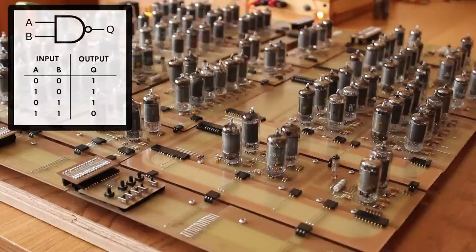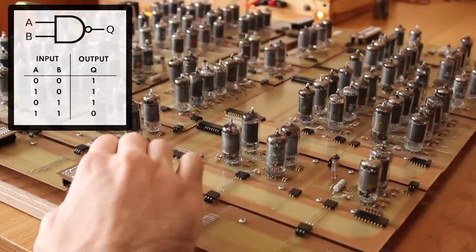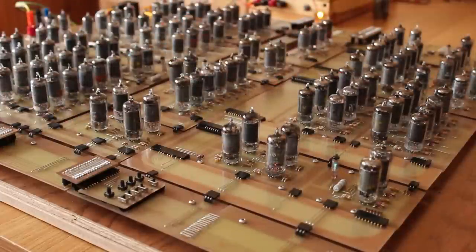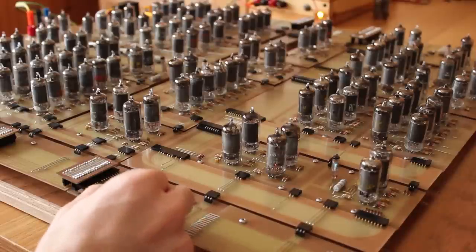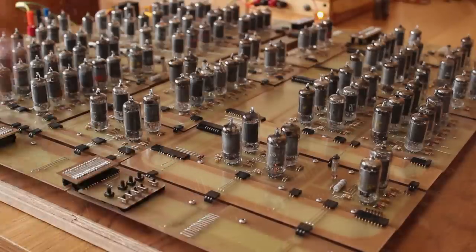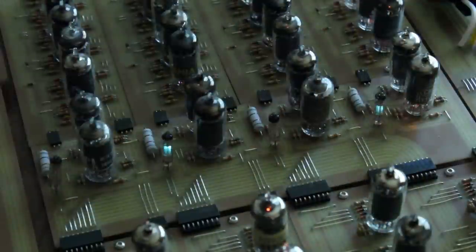All right, so we're effectively doing a NAND operation. That's awesome. So we'll go ahead and store that into the result register, which takes our result register to zero. So we'll turn the data off, and then we'll check the final logic function, which is exclusive OR. And that is instruction 0111. So we'll go ahead and clock that into the instruction register. I can see it's stored over there.